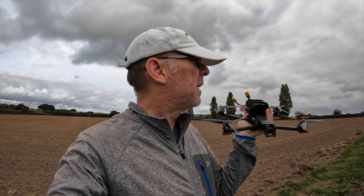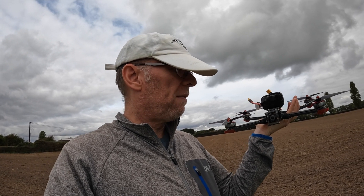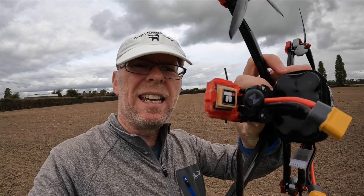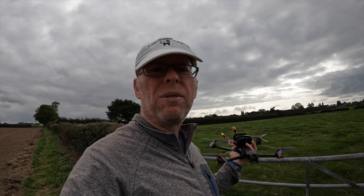I thought it must be a low signal drop-out. That was pretty weird - I'm not quite sure what happened, I have to look back at the DVR. I was getting some pretty bad link quality going around there, which is why I brought it up a bit, but it did go down next to houses over there which might be the problem. I've tested it and it seems fine, it hovers. I don't like the way this antenna sits - it sort of doesn't come out all the way. For the next battery test I'm going to fly in a direction that has less houses, although slightly more cows. My best guess is that was a loss of signal and I did not have rescue mode enabled because I took off with only five satellites. Let's try it again with the Dogcom.